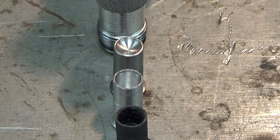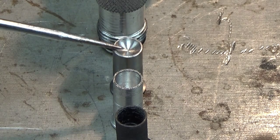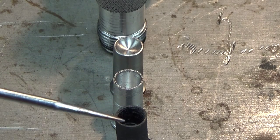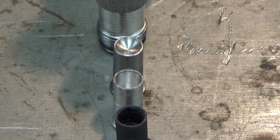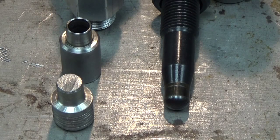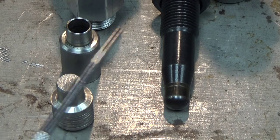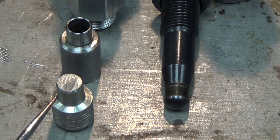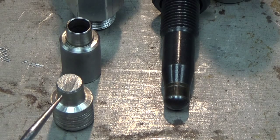So that's what I'm up against. I originally dealt with the issue using the seating die — this is a Lee seating die. Here's the original bullet seating part of the die, then I made one with aluminum and one with plastic. When the aluminum didn't solve the problem, I decided to look at the expansion dies. This is an RCBS expansion die, this is the original Lee expansion part, and this is the one I made to solve the problem. I made a bunch of different sizes and did some experiments.